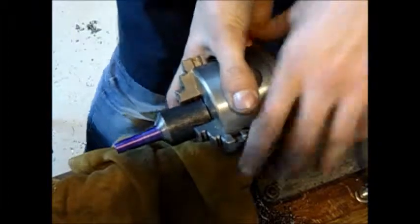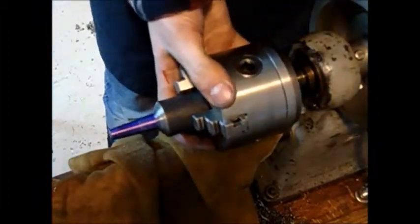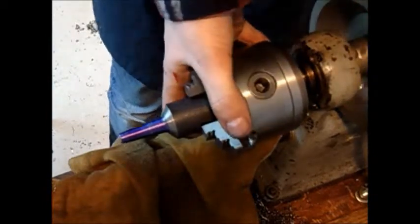It's wearing from here to here, and as you can see it's sitting in here solidly, so I guess that should be enough. We're leaving it at that and then we're cutting off a little bit here, drilling it through, tapping it, and then we can get from the back of the spindle with a threaded bar, get hold of it, and turn the 60-degree taper around the front.